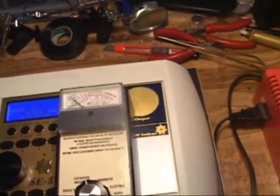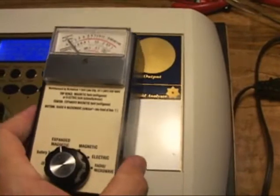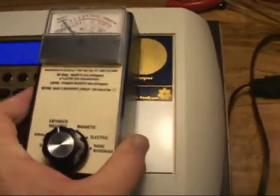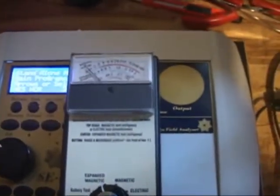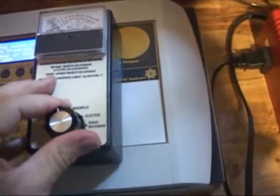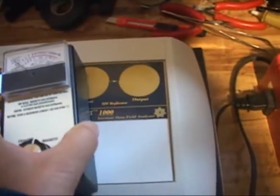So that's an energy saver bulb, and they have quite a bit of magnetic field around them. So now I'm going to turn the SE5 on, and the meter just barely, barely moves at all. There's just a little bit of fluctuation, way down about between zero and one. Now let me turn the lamp off just to make sure that we're not picking up any extra from the lamp. It looks about the same. So now we'll check on magnetic level. Go right up to the SE5, and that's zero.